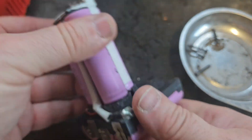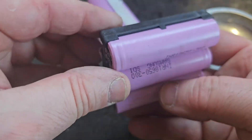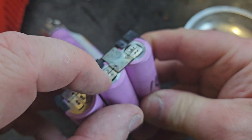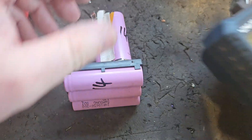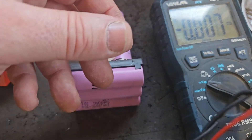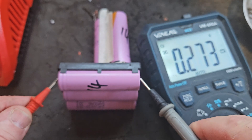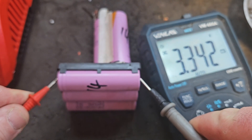We're out of the pack now. It's all about measuring the banks and understanding where they're connected together. These are easy — you can see these two up here because they're connecting in parallel, positive to positive and negative to negative, so we can test them first to see what they're like. That one of the low banks is reading 3.34.